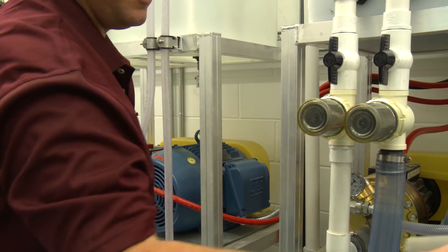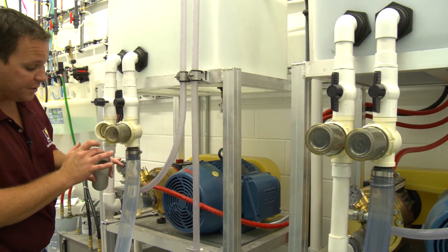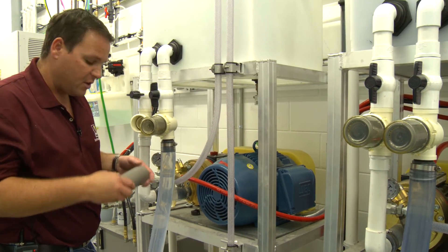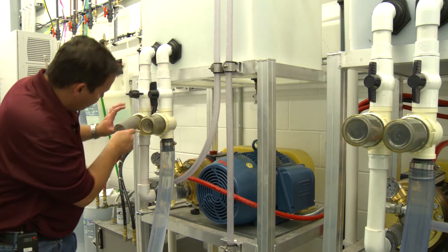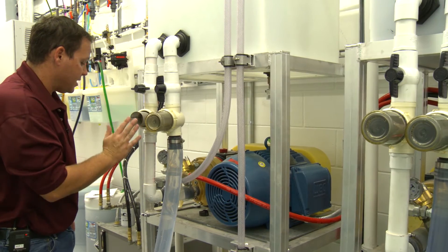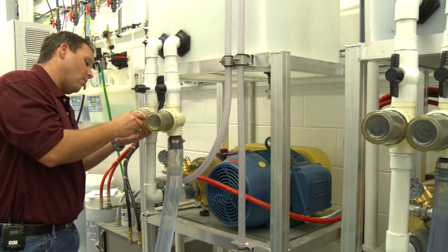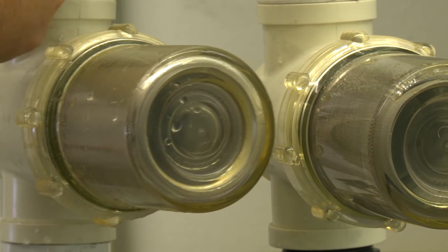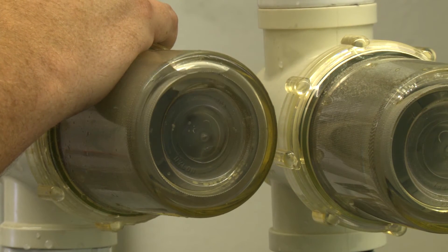My helper's back with our nice clean filter. It's important when putting the filter in, we don't crush the edges of the filter — if we crush the edges, it's not going to do its job. Sometimes, after years of cleaning, they can get beyond their usable life, and we do sell replacements through Sonny's. The best way to put it on is to look inside, pop it back on, ensuring it holds itself in place nice and even. Then put the strainer cover back on, looking to make sure we don't crush the edges. Once it's in, hand tight only — no need to over-snug it. We're going to open our water back up and check for any leaks.